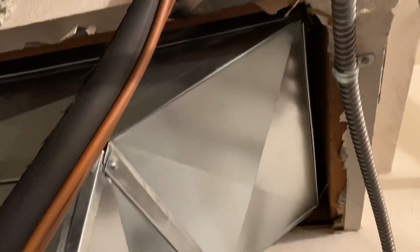Here is the upper plenum. I tapered it out for improved airflow — I think it's a 20 inch by 13 inch plenum and then up at the top it's 20 inch by 26 inch by 13 inch. There's a Pittsburgh seam you can see, and I can give some examples of how I did the Pittsburgh. It's actually pretty quick and it's all done on the brake — repeatable and consistent.